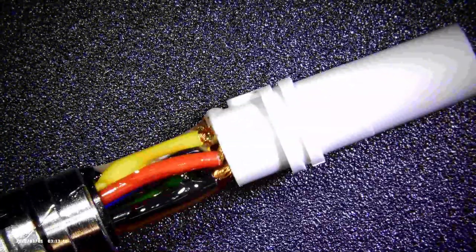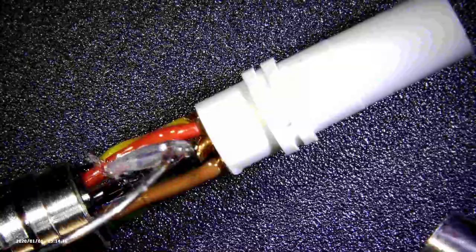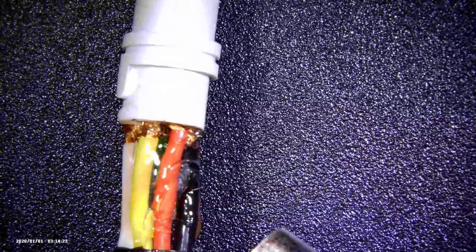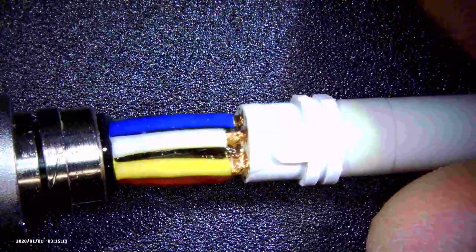I've got a little bit of a hole here by the black wire and the red wire. I'm going to take another piece, stick it right over that point, and melt it down into the connector — that should be my final piece. Because that's a little detailed point, I'm using a tiny piece of glue. Same process — heat it up and blast it down towards the connector body, blowing the glue towards the connector to make sure I get it between all those wires. Rotating it because it's all molten. Make sure you don't set it down on the desk at this point — you don't want all those wires sticking to your desktop. Make sure that you don't get any glue on the connector body itself because that's where the shields are going to sit.